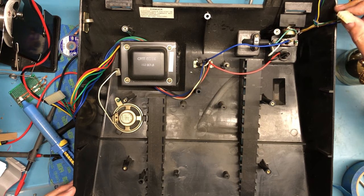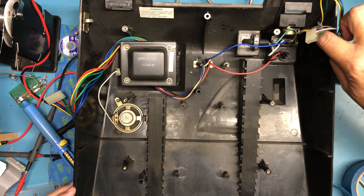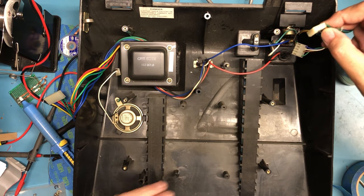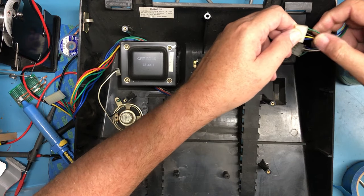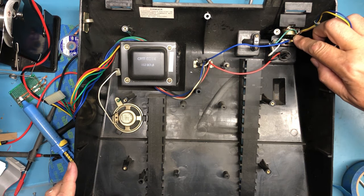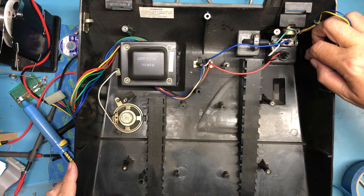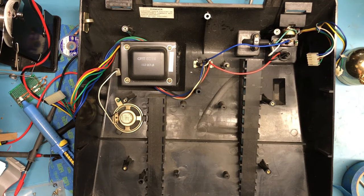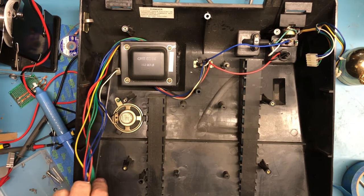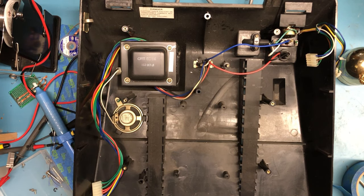The brown and white wires go to the two outsides of the potentiometer, and then the black, orange, white here go to it - those three, with the yellow being the center and a green that's probably some kind of ground. There's a large resistor coming from the power switch over there. And of course this is just all the taps off the transformer. I thought that was a switching power supply looking at it, but I realize now based on that huge heat sink, it's actually a linear power supply.